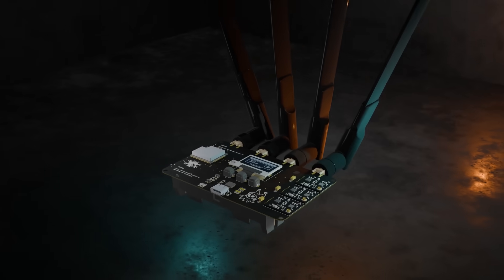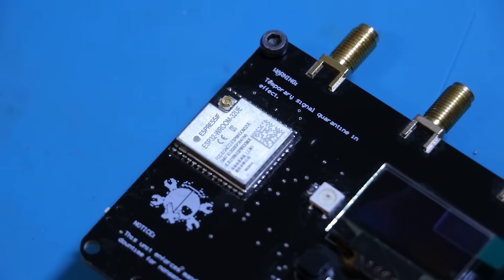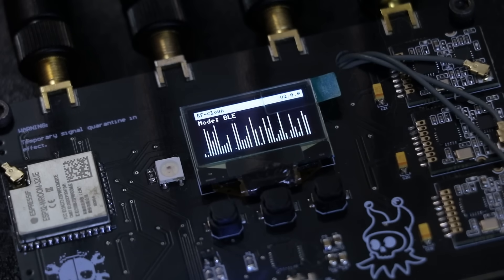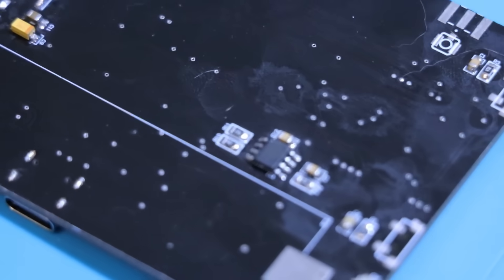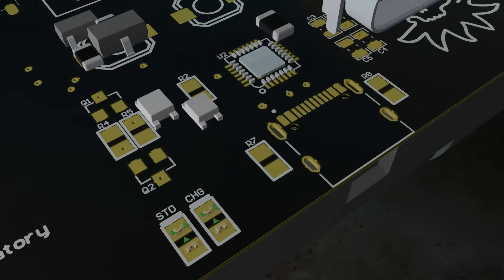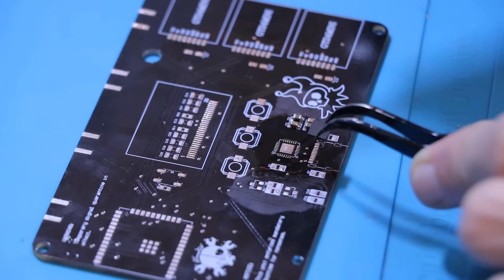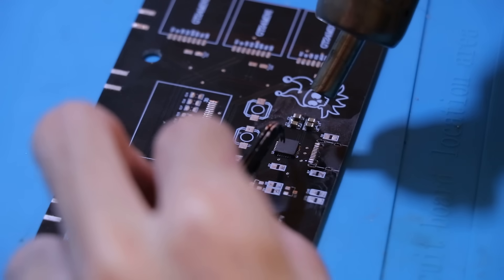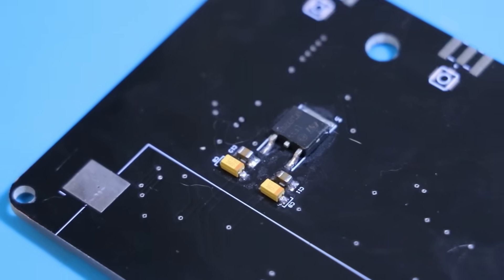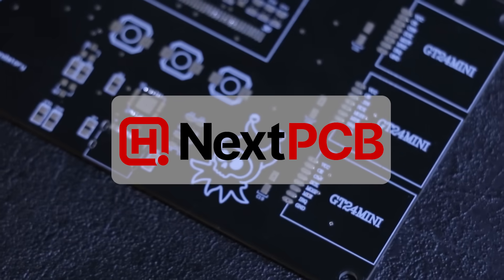There are plenty of changes in this version, but some parts still remain the same. The RF Clown's main microcontroller is still the ESP32 WROOM32U, since I also plan to use its Wi-Fi and BLE features. The battery charger is a TP4056, which works perfectly for the single-cell battery setup. To make programming more convenient I added a CP2102 USB-to-serial chip so you can program the ESP32 without any issues. And finally there is an LF33 voltage regulator, because we need a stable 3.3V supply for most of our components.